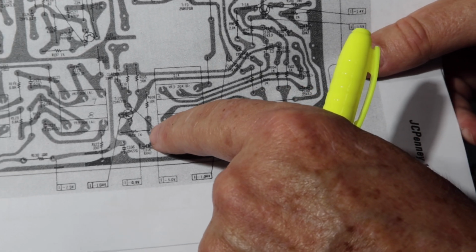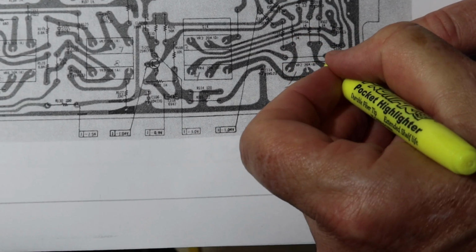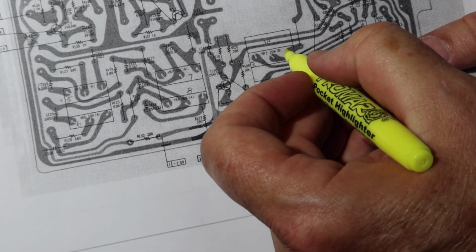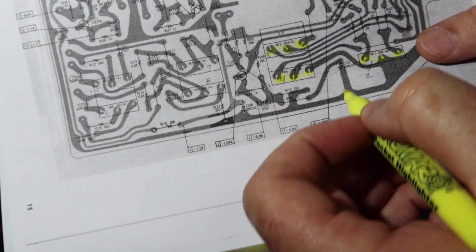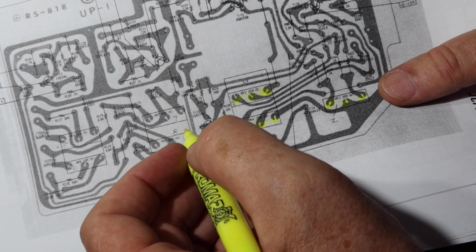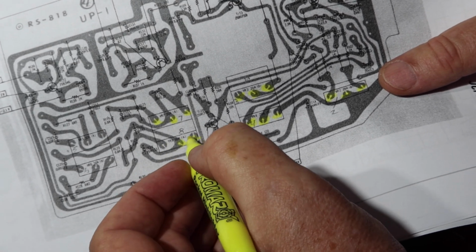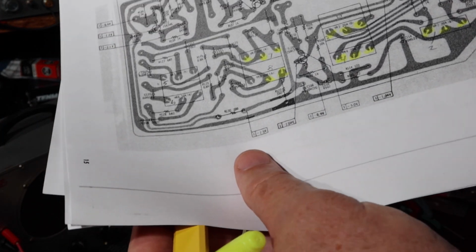Alright. So we were getting no noise there, or there. Right? We had no noise on the volume control there, or these 3 points here. So those are all in the clear. On the bass control, it was clear on this channel, but on this channel, that one was noisy. Alright, so let me put a hashy looking shape on that.